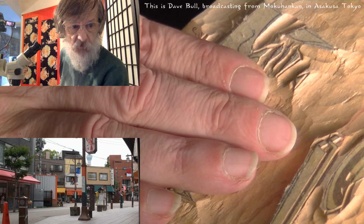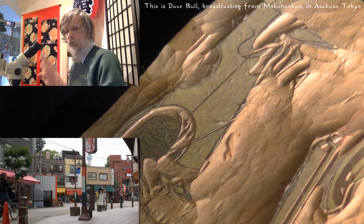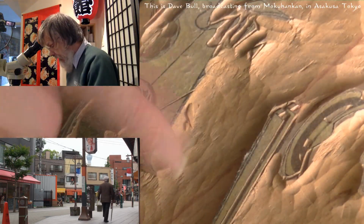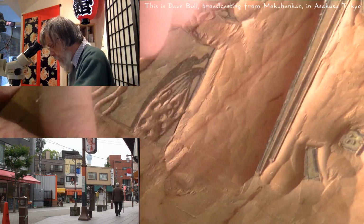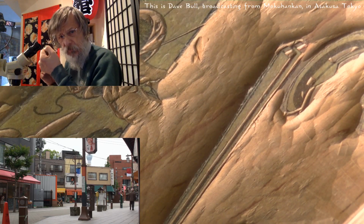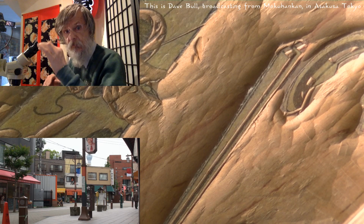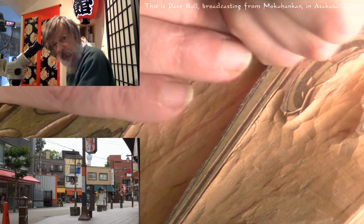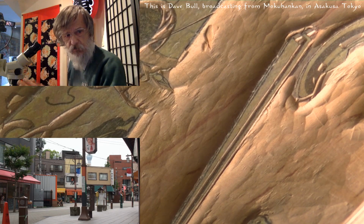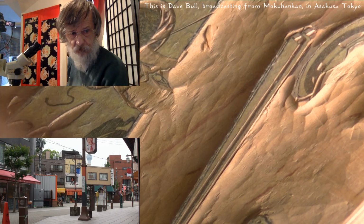Moistening the block? No. Moistening would make it absolutely worse. You make this wood wet, it just starts to gum up and stick. In some cases, this is too wide of an area to be mucking about with. But in some areas when we're carving, you put a bit of camellia oil on the surface of the wood with your knife to cut. Making this wet would not help in any way whatsoever.